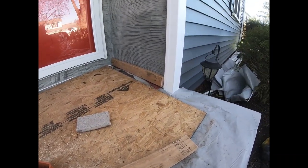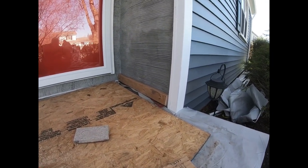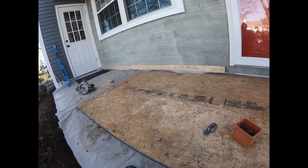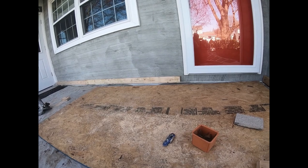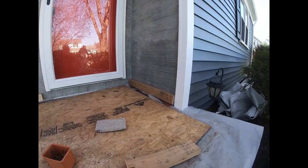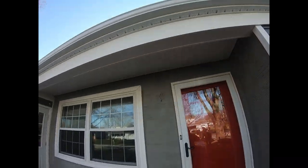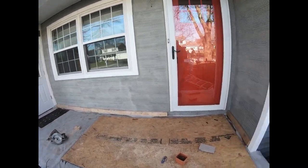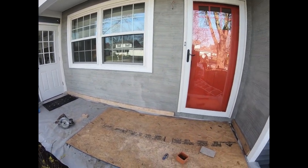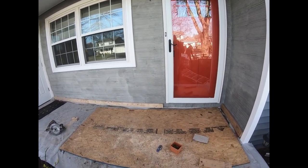This is our starting point — I got level boards laid up right across the bottom. What we're going to do is stack right on those boards and do the whole front, and at some point I'll pop those boards out and cut the stones to fit underneath — just got to shorten them up a little bit.